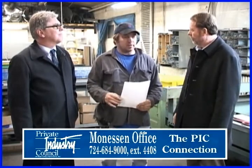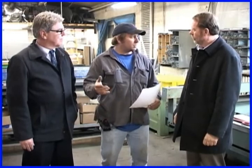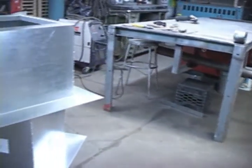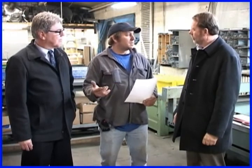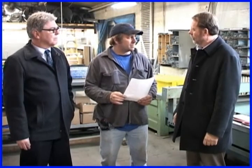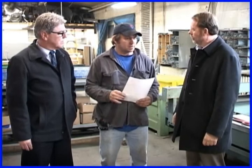Well, the first thing we do is talk about safety and explain to them to shut off the gas, the electrical power, oil if it's an oil furnace, whatever. And the metal that we work with is very sharp. If there's an air conditioning heat pump retrofit, explain to recover the Freon so it doesn't damage the atmosphere, and we show them how to do that. And wear safety glasses when you're doing it. Safety first and environment.